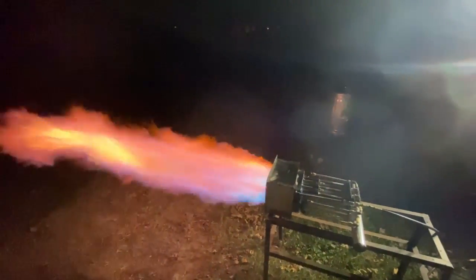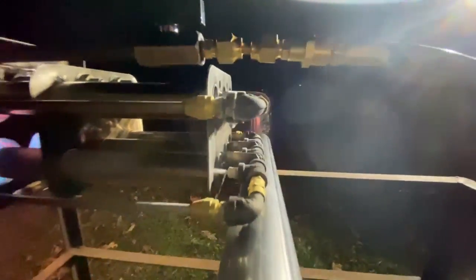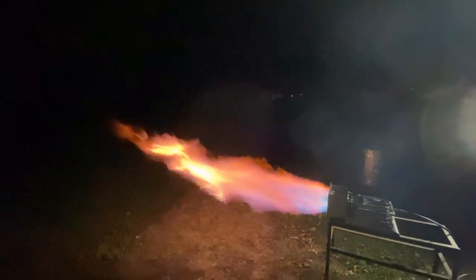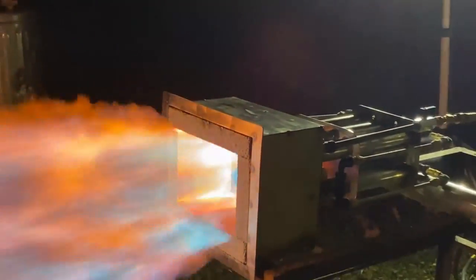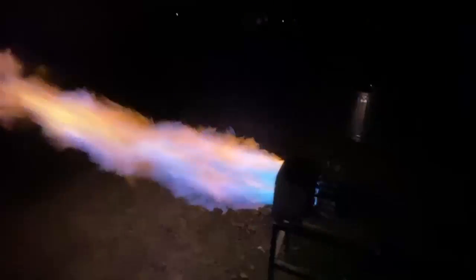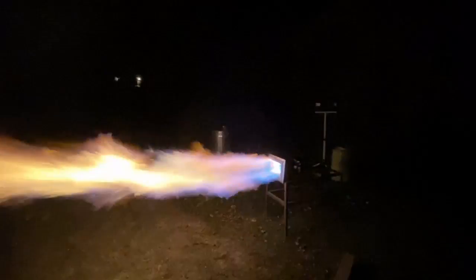Unlike the condition you get with a regular propane bottle setup where you lose power as soon as the bottle starts to drop in temperature — we would have frozen a long time ago with the conventional setup. But we got a leak right there. That's kind of one of the reasons I want to get that loop — I wasn't able to tighten that fitting because my pipe was about a 16th of an inch too small, so I backed that one out just a tad to get it to fit. That is why I want to get that loop in there, guys. I will be taking those pipes off and correcting them. The straight-line pipe I knew was going to be a problem because they're flare fittings, so the tube has to be longer than the space it fits into for insertion. I don't know why I didn't think of the single loop — that way it can flex.